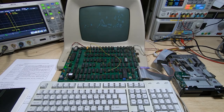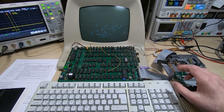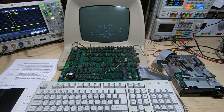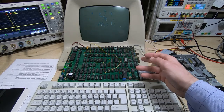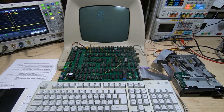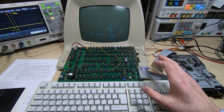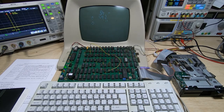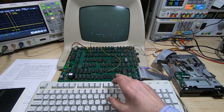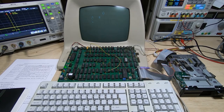It looks like the interface is doing what it's supposed to, so I can remove the bodge wire and carry on testing. I've already tested the RS232 and that also works fine - both receive and transmit. So the next step is to load the floppy drive test code into RAM, try formatting some disks and writing to them to make sure that works. If that does work, then in the next video we'll start looking at the DMA system. Testing the DMA is a lot more complex - there's a lot involved with DMA transfer and how it interacts with the floppy drive control system, so I'm pretty sure we'll encounter some issues. But this board is working quite nicely so far.